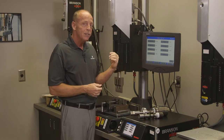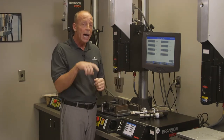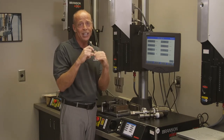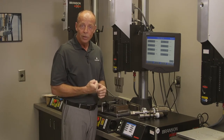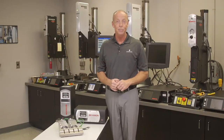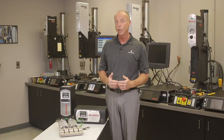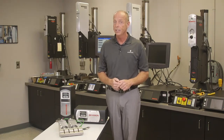Ultrasonics offers this very sophisticated weld by energy approach with high-low parameter ranges. If you don't achieve a seal within that, you get a latchable alarm function to reduce quality concerns down the line. What we learned from the initial testing with the benchtop welder, at some point we have to bring to production. Those are key parameters that we want to replicate in production.